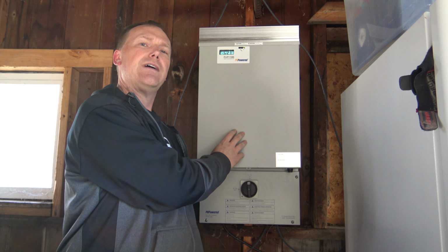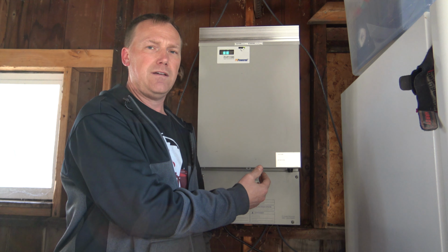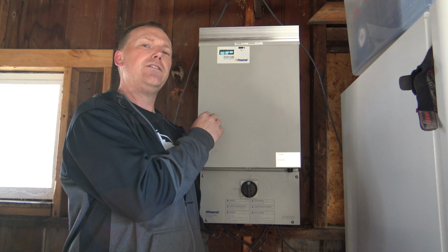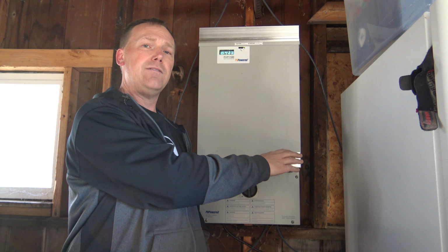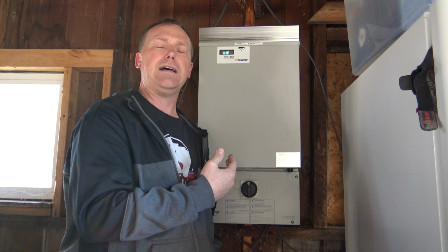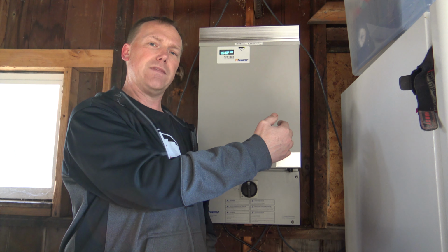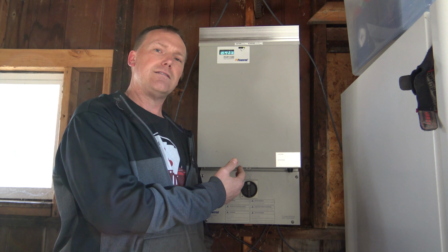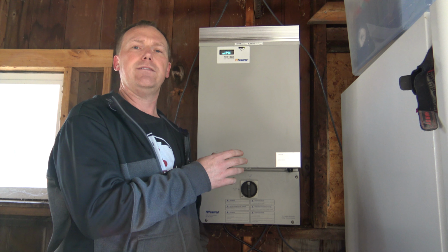This is 125 volt household current. It plugs right into an electrical outlet, and how it works is it pushes back about 128 to about 131 volts back through the line, and that will either be used throughout the house, or if the house isn't using much electricity, it goes back into the grid and it actually will run the electric meter backwards. This isn't tied into the circuit breaker like a 220 volt inverter would be.